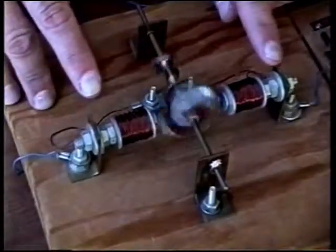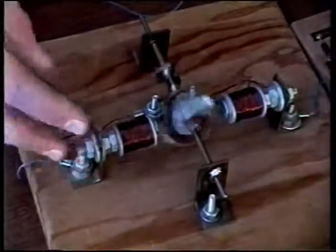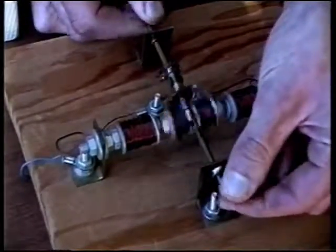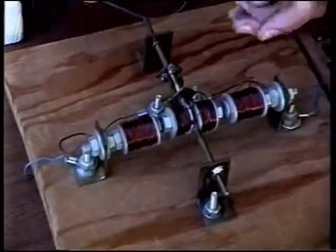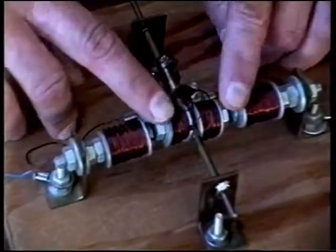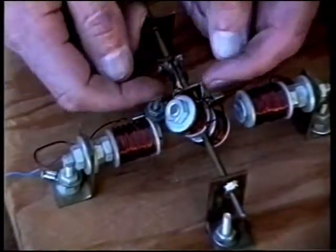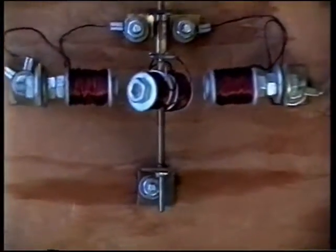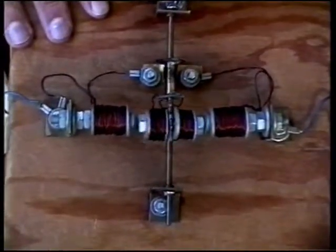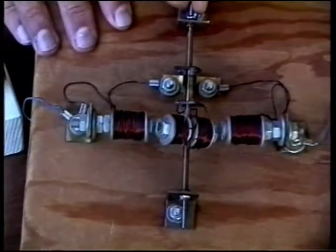Let me tell you about motors. They have what's called the field magnet — here I have two sides of my field magnet, this one and this one. And spinning about on its axle is called the armature. You have to feed electricity into this electromagnet. How does electricity get there? These two little pieces right here are called brushes. The brushes carry electricity into the inner electromagnet, the armature, by conducting it into either end of the coil through two half cylinders. Here's the break between the two half cylinders. As I slowly turn the axle, you'll see I'm on the top cylinder, then the break, then the other half cylinder, and finally back where we started.